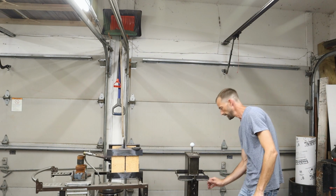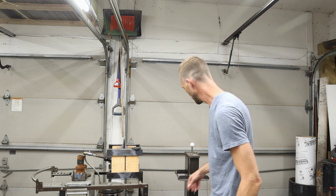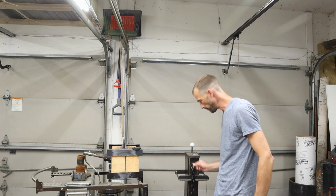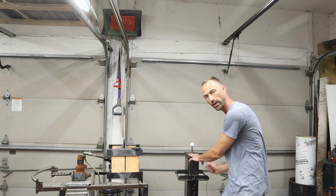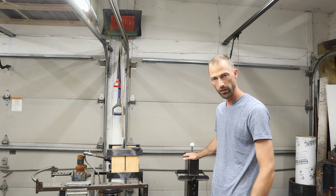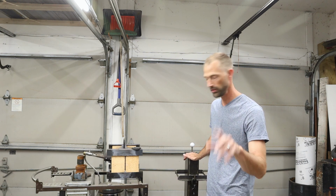And what I'm going to do is heat my forge. I'll heat my chain. This is my oil heating chain. I'll go ahead and heat this in the forge, and then I'll heat my oil tank with that chain to get my oil up to the correct temperature, about 125, 130 degrees.